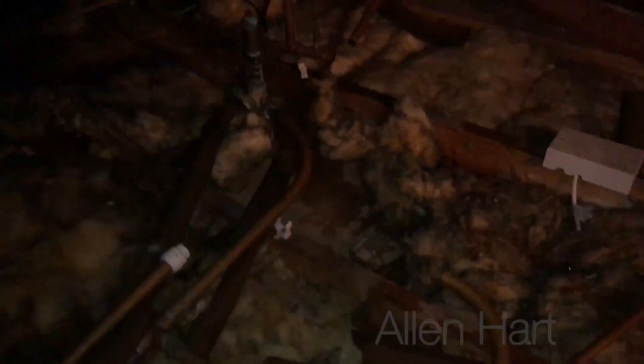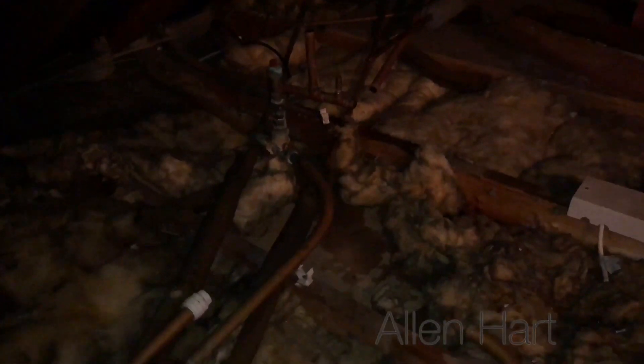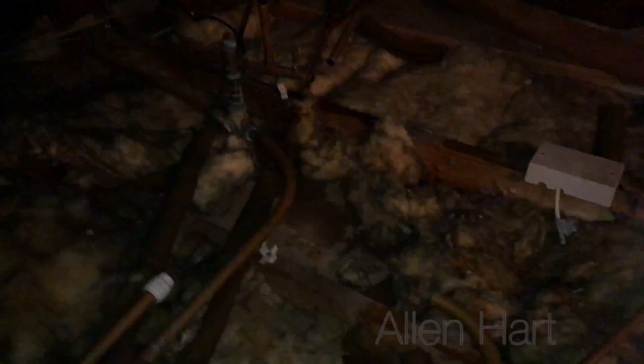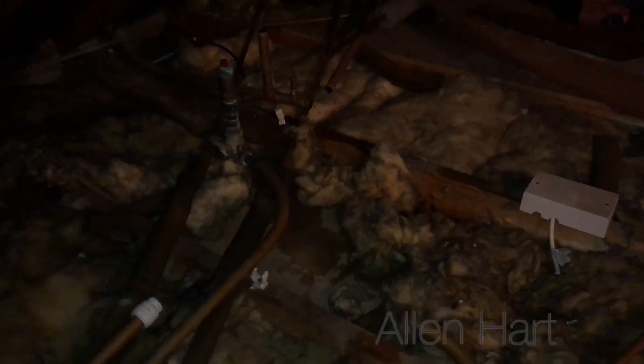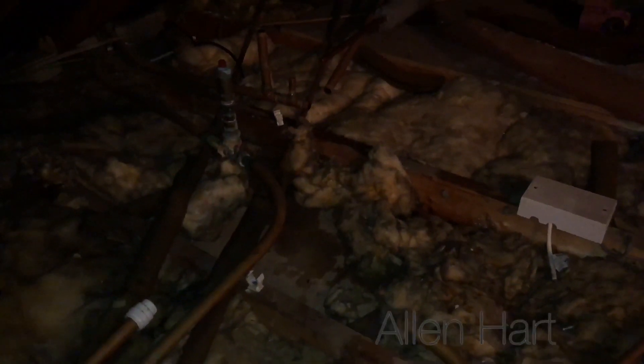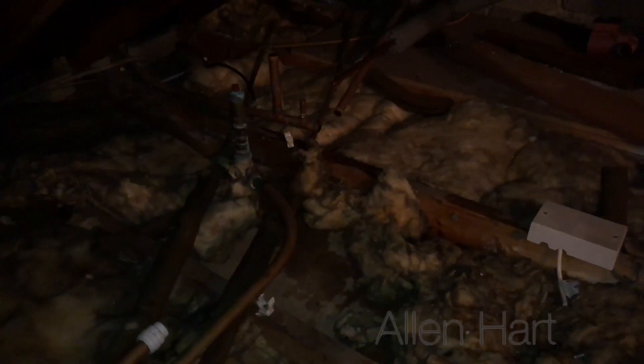Because we want to make sure this job is 100% perfect for the customer after we've gone and there's no problems, we've cut all the existing stuff out and we're going to repipe all this. The heart of the system — we've cut the Y-plan out and we're going to update to an S-plan, update the wiring center, and put a Nest thermostat in so they'll be able to control heating and hot water from their smartphone.